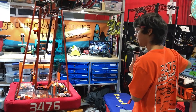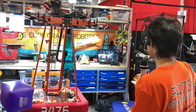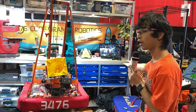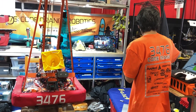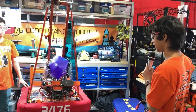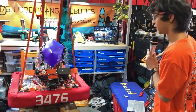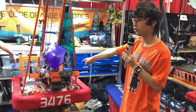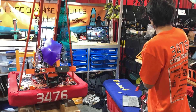Now we're going to showcase our auto pickup. I go to the pickup position and place a cone — you'll notice it auto-grabs and automatically closes. The driver just needs to deploy the mechanism and the robot takes care of the rest. If we go into cube mode and go into pickup again, that all happens automatically as well. What's really cool is that the operator just selects the specified scoring position and we automatically determine how much pressure is needed to hold the game piece.